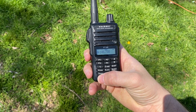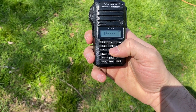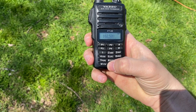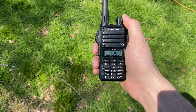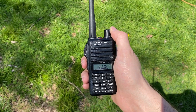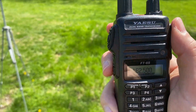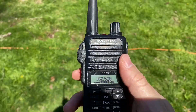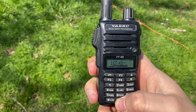With the NOAA weather radio stations, there's one here in this very county, and these usually run — some of them are about a thousand watts, some are more — but it's narrow FM like 2 meter ham is. And this one's very nearby, so it's very strong. This one to my north on 162.450.